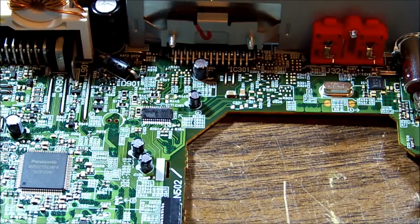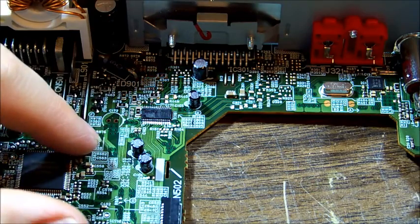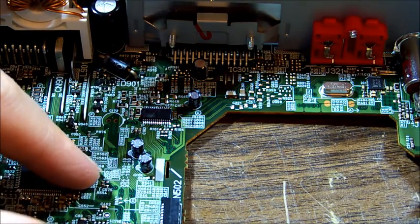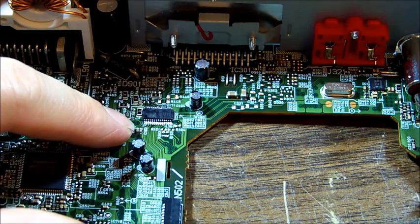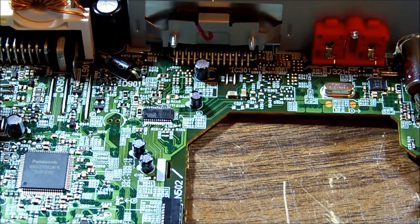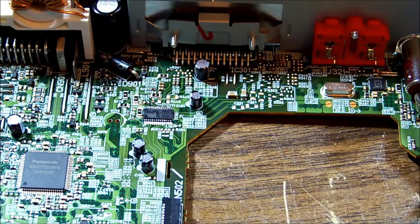Now, I haven't quite finished yet, because I don't have a schematic. I don't know if the input leads are connected anywhere else. That DC offset has got me scratching my head. I think what I might do is lift the input pin off the board and see if the DC level on that remains, and if it does, I'll be inclined to think the chip is damaged and it's just passing rail voltage straight out both ends, out the input end, out the output. That's possible, but I'll lift that pin off for a start, and we'll see if it goes away.